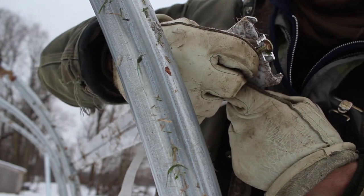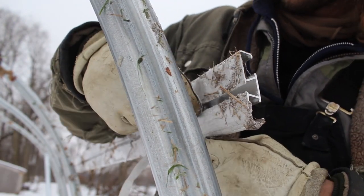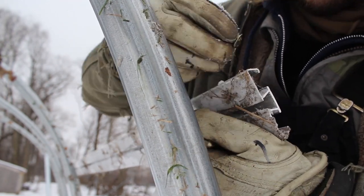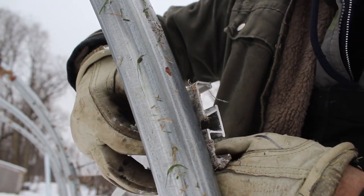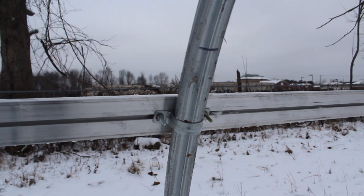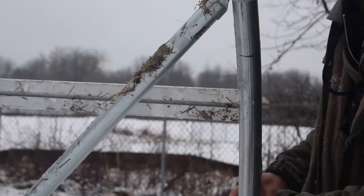After those two screws are in, you've now completely attached the hip rail to the hoop right where the two pieces of channel come together. After you're all connected up there, you'll go to the free-floating end, slot through more bolts, and connect two-hole straps to those hoops that make contact with the double channel hip rail. Once you attach those bolts to the hoops, you'll repeat the process we covered earlier on all the hoops that make contact with the double channel. Where your double channel ends, you'll put the splice plates on and connect the next piece of channel all the way down your structure and on each side, repeating the processes we've already covered.